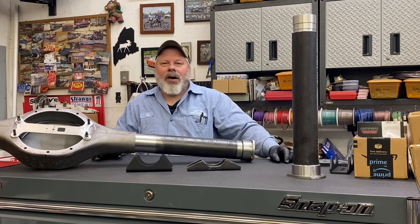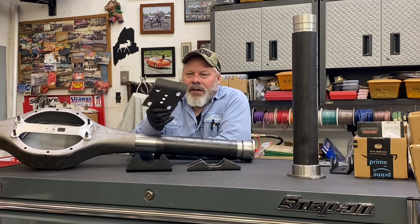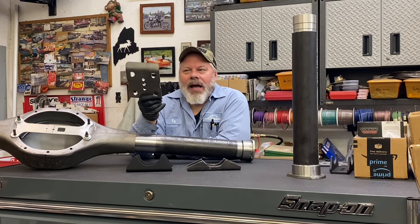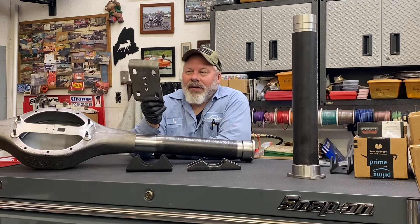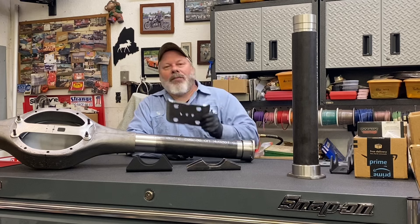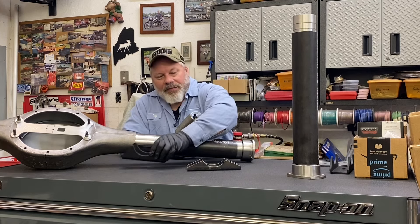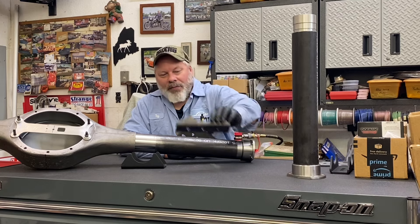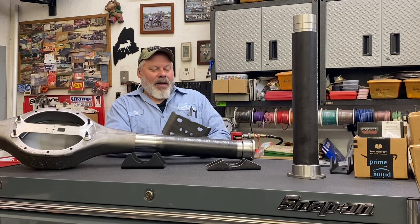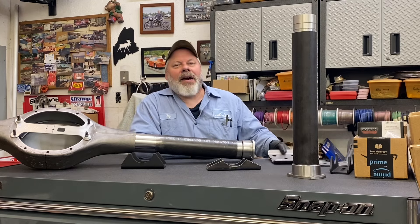I have several sets of U-bolts also out for delivery any minute now. And I went ahead and bought some spring plates for the bottom — I don't believe I could even build these for what they cost; I think they're $33. I don't have any quarter-inch flat bar in stock at five inches wide so I'd have to buy some anyway, and these are nice — everything's punched and it gives you locations. I'm going to use the center one, but you can move the rear end forward and backward by moving the spring plates in the perch. This perch has three holes as well. I like to use it right in the middle, the way it's intended. I may also use these to go ahead and make my own traction bar — they're raw metal and they just invite you to go ahead and modify.